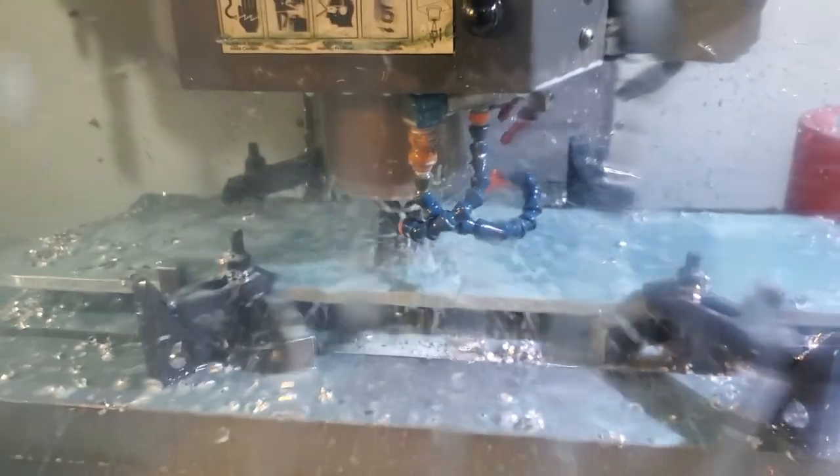This is one of the loudest pockets of the four — once the end mill gets to the back side of the pocket it is unsupported, and that's where you get that chatter from.